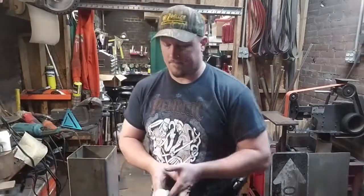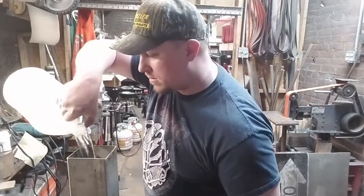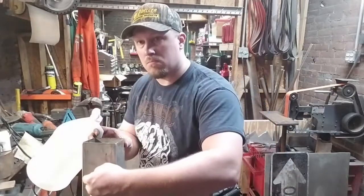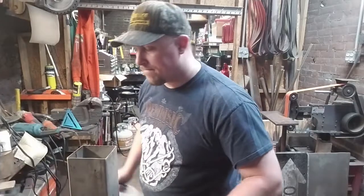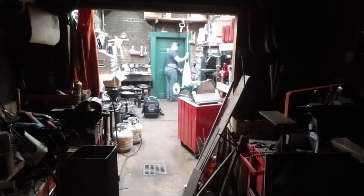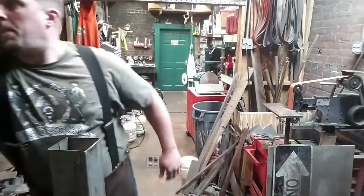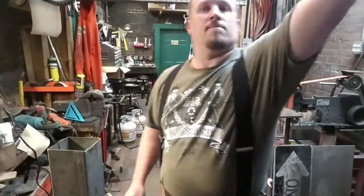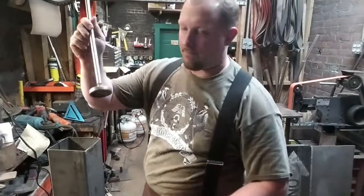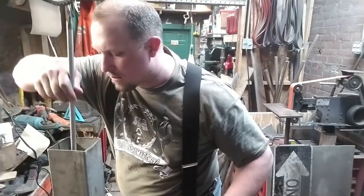And what I like to do is dissolve it away using ordinary household white vinegar. Now, obviously, that's not something you can do if you're in a hurry, but if you have the time to let it soak overnight, and I do, then by the time you come back in the morning, all of that pesky fire scale will have been dissolved away, and you'll wind up with a nice, clean knife blade that you can begin to work on. That's exactly what we're going to do. I'm using a magnet because I'm a blacksmith. I have cuts all over my hands, and vinegar is kind of painful.